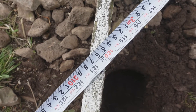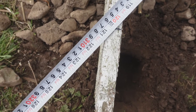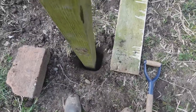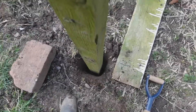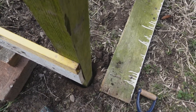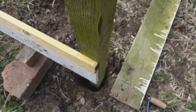As you can see it should be at 120, which means this piece of wood needs to move to the right slightly. I haven't got three hands so I'm going to have to turn the camera off. There we are, it's now nearly bang on — bang on enough for preliminary purposes, so I will put my first post here and screw it to the timber. Now you want your post holes to be fairly flat bottomed. The reason is that once you've got everything leveled up you find you need to move your posts slightly to square the building. It will still be level if your posts are flat bottomed and your hole is flat bottomed — it just makes life a little bit easier.